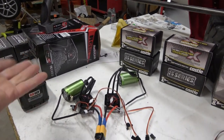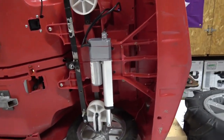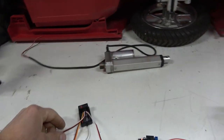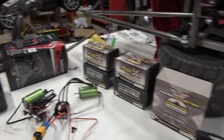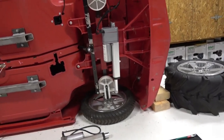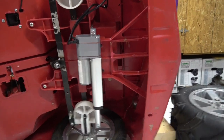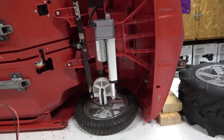You want the brushless motors by the ESCs — short and sweet — and then it runs through the body. For all of the steering we highly recommend linear actuators. You've got a radio and your ESC — picture an RC car, that's it. The steering is the tricky part that gets a lot of people stumped. We just did the video today on this build putting the steering in, and this is going to be the follow-up in more detail.